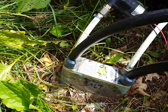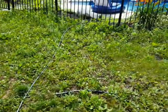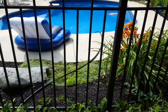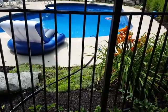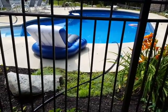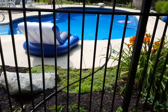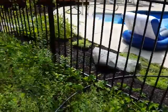This whole thing gets to a steady state, and when the sun is shining super bright, if the water in the pool is 78–80 degrees, the water coming out of the irrigation tube from the solar system is probably about 90 degrees. I'm running maybe four to six gallons per minute out of the irrigation tube when it's running full bore. What I notice is that on a nice sunny clear day I can bring up the temperature of the pool about three or four degrees — and I'm not paying for any of the energy; it's just coming down from the sun.